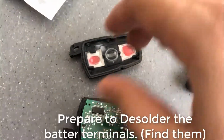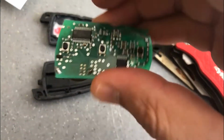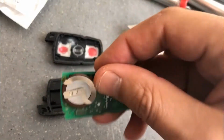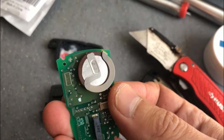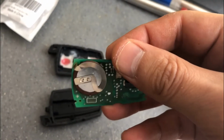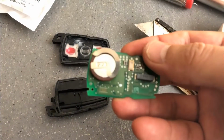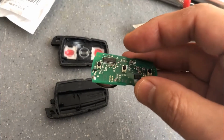Okay, now that I have the two halves apart, we're going to be preparing to desolder the battery terminals. So here we have the circuit board, and if we look here, we have the two terminals that I'm going to be desoldering. On this side we have the battery, and you can see it's a VL2020. It's 90 degrees apart, and Amazon will distinguish it in the description, so just look for that one.